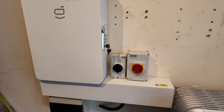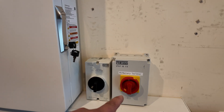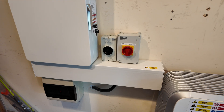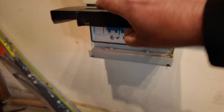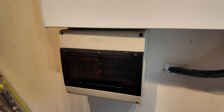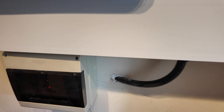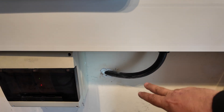That's the versatility that the IMO range of isolators gives us — this is the DC PV2, so we can isolate those two strings combined in the same isolator. We've got our Proteus IP67 rotary isolator, 63 amp rated — although it is only a six kilowatt inverter, there's just so much more wiring room in there. We've got the pen fault detection consumer unit down here, which was existing to the customer, brought inside from under the meter cabinet. And we've got our sub main coming down here — 25 mil five core — bringing the grid feed into the gateway and returning power back to the house loads.